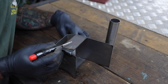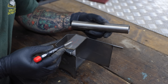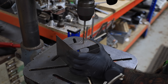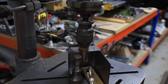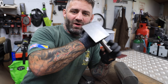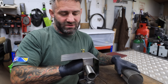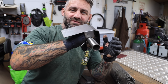I've marked out where the handle is going to go. I'm going to drill it through first with a 5.5mm bit to align it and then use a 30mm hole cutter so I can slot this through and TIG weld it in place. I've got all this together now and I can't quite clench my fist when wearing my hand in there, so I'm going to cut a slot out here and TIG weld it in place so I have a bit of a dome on top and enough room for my fist to fit.